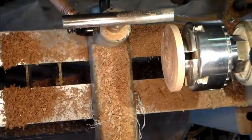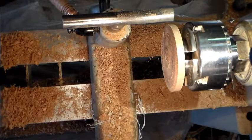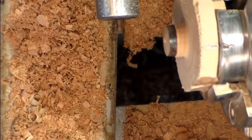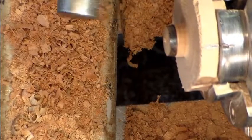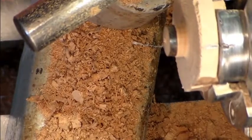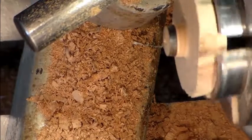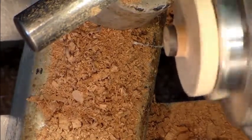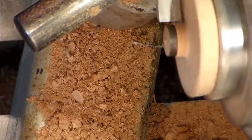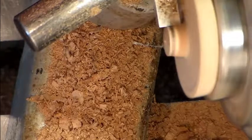It's set up for the final turning of the top body. Oh, this is a little jam chuck, a scrap piece of wood that I had. And I'm gonna put a little nub on it so that the top fits on it, then we'll jam it on. That's why they're called jam chucks, because you jam them on.